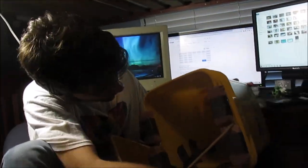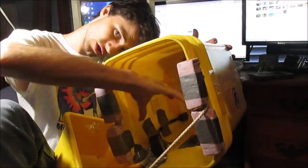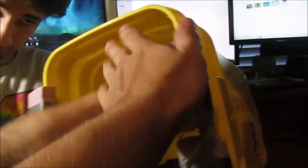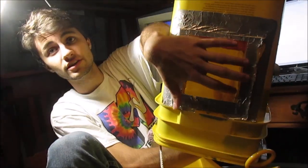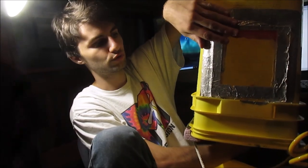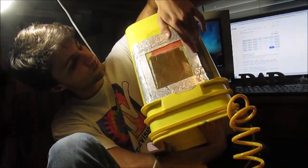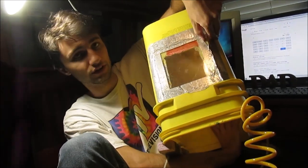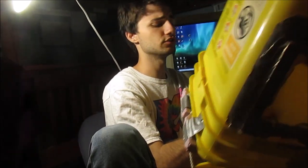The hose is at the top, so fresh air disseminates downwards and pushes the carbon dioxide and carbon monoxide out. It just sort of bubbles out the bottom, or through any cracks. Being that it's 25 pounds per square inch of pressure, it prevents the low-pressure water from coming in through any cracks, so your helmet doesn't flood. And that works down to about 30 feet or so.